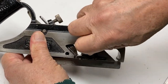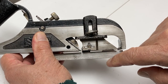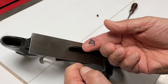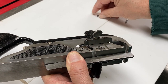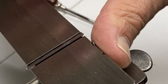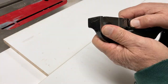On the other side of the plane you see the depth stop — it simply rides on a little groove, you can see me just moving it up and down. Below there is the spur. The way the spur works is you can leave it turned in so it's not in effect, or you can put it back with the spur sticking out. Even though this plane is from the 1940s, only one of the three spurs has ever been sharpened. When cutting a rabbit in end grain, the spur cuts the ends of those grain fibers so they don't give tear-out — you can see it's just sticking proud of the base of the plane.